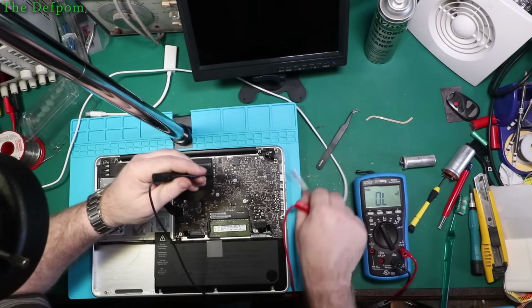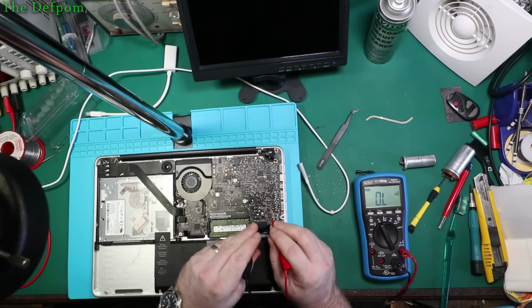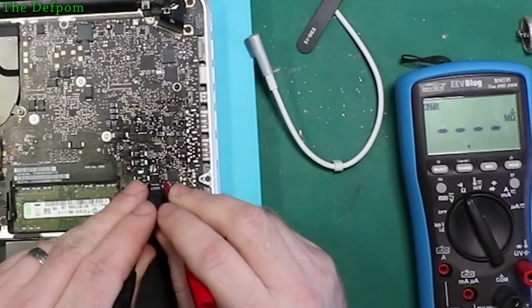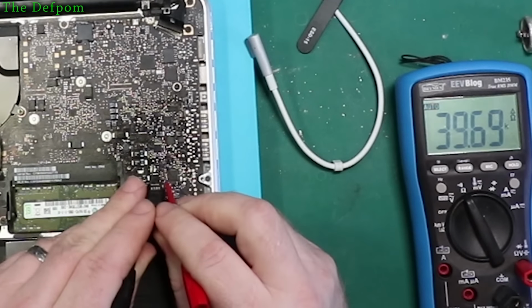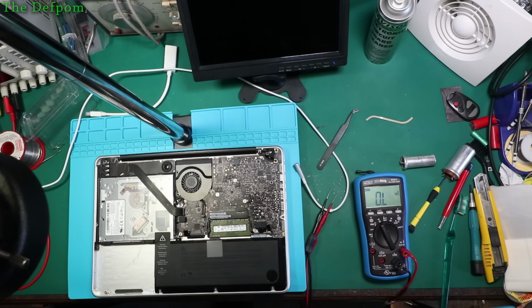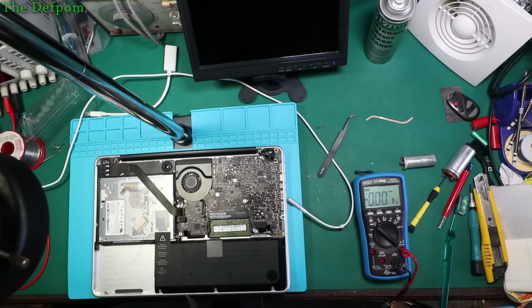Let's take it off. I keep forgetting to take it off. That is vertical resistors here. If I measure these two here, there and there, I should be measuring about 39.4 or something. 39.7. Yeah, okay. Close. So that looks alright. Well, I should check for voltage at that point too, shouldn't I? So let's do that. Just because the circuit looks okay doesn't mean it works.